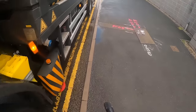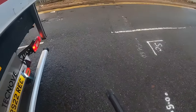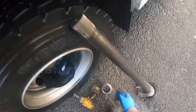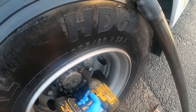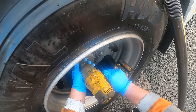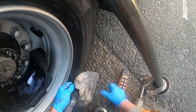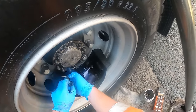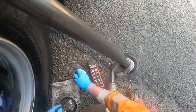Right, take that there. Take my remote as well. So you can take the other half shaft out if you want on the diff lock side, but you've got another row of splines to get back in, so it just makes it a bit simpler to pull the one opposite the diff lock mechanism. Right. These little collars. Hardly any oil really came out on that.